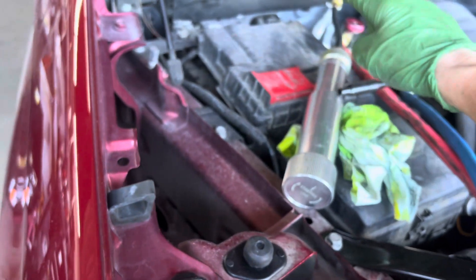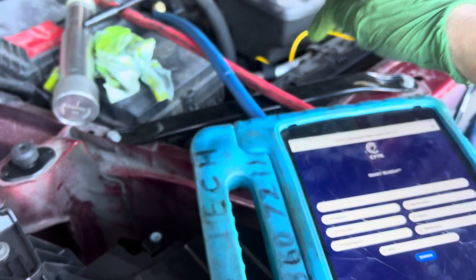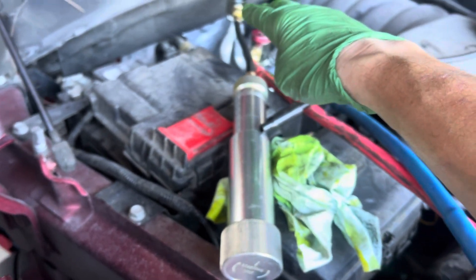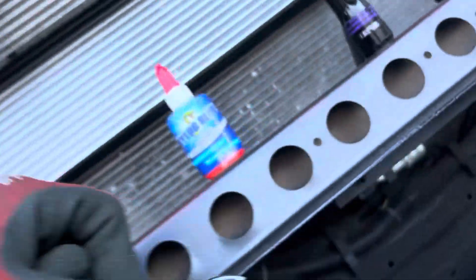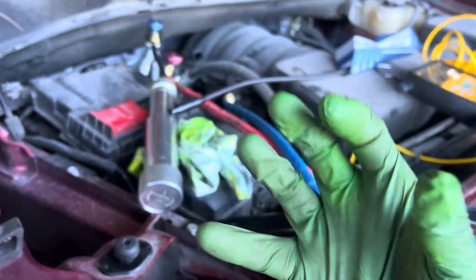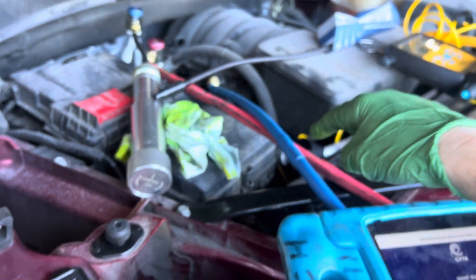I have the oil injection cylinder with dye and oil ready to put in. Normally I'd never put 45 milliliters right before the compressor - that's a big slug of oil that could damage it. But on this vehicle, even though there's no accumulator, there is a muffler. That big round thing above the clutch - the muffler has separate chambers that prevent oil from going directly to the spinning compressor.